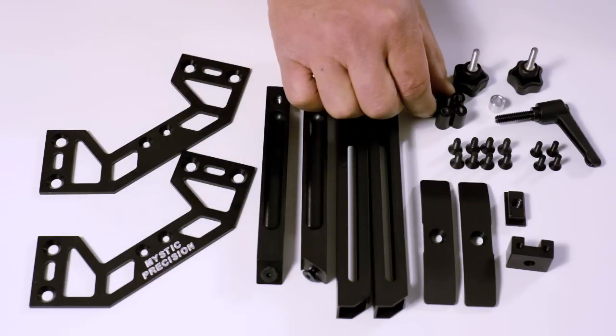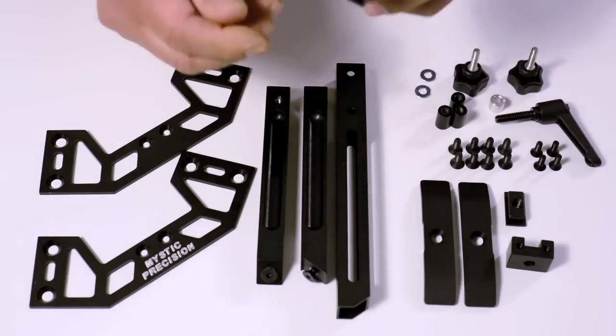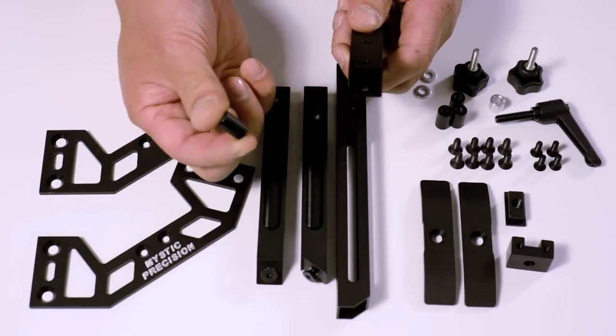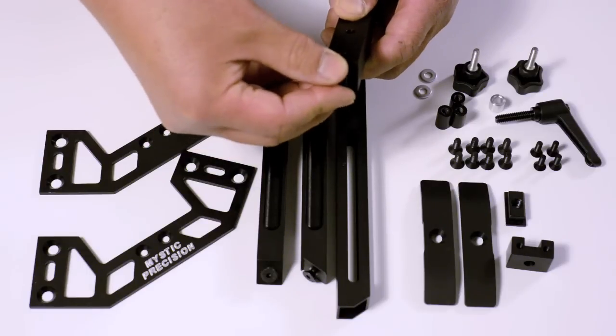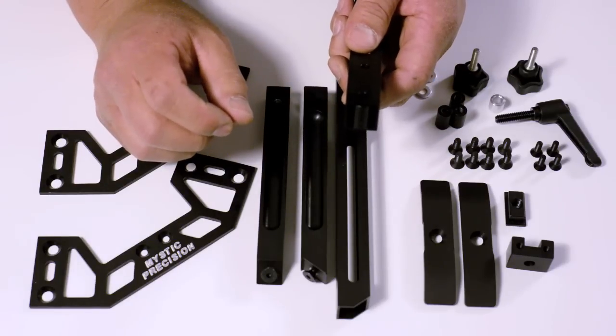Another quirk of the type of tubing we're using: the spacing in these tubes can vary a little bit. When we machine these inner spacers, some of them can be a tight fit. If you find that you need to push harder, you might want to put a little bit of sandpaper over the top and they will go in.